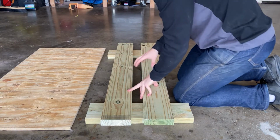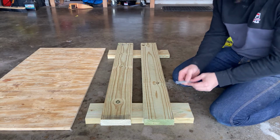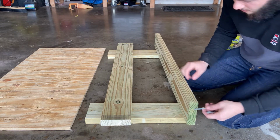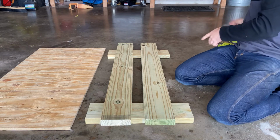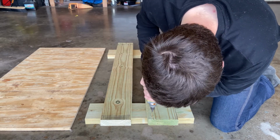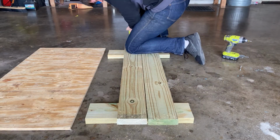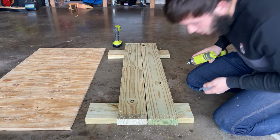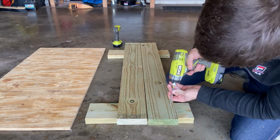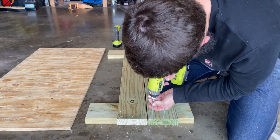All right, here are my two end boards. These are 2x6s, and therefore I'm gonna use 3 screws, and they're gonna go in on the side like this, you'll see. To avoid these things from splitting, I'll put 3 holes, half an inch out. Now to make it even easier on you, take all your screws and put them in, just a little bit, like this.